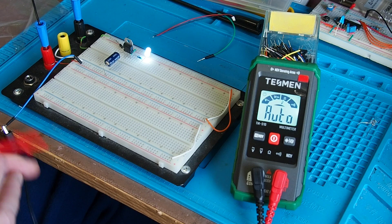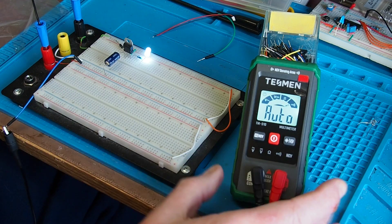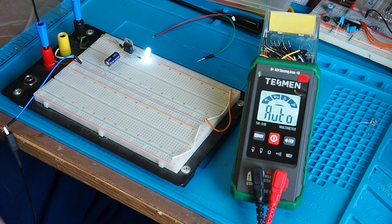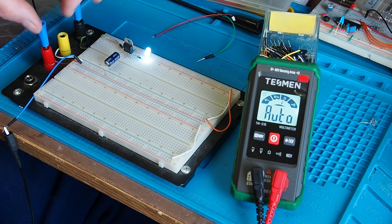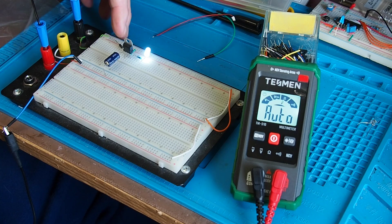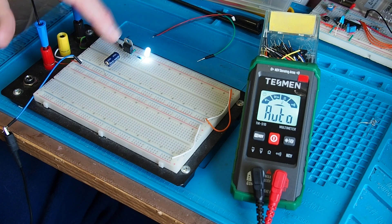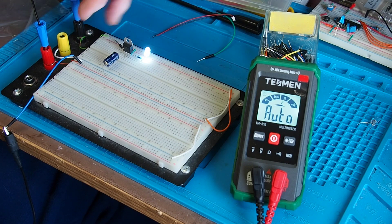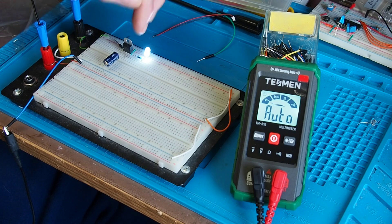I've built a little circuit to test the smart capability of the meter detecting both AC and DC voltages. I've got an AC supply coming in on the top left, one diode working as a half-wave rectifier, a 100 microfarad smoothing capacitor, a 7805 voltage regulator configured in a basic setup with the centre pin to ground, and then a current limiting resistor and an LED as the load. The circuit takes AC, rectifies it, smooths it, produces 5 volts, and that's running the LED.